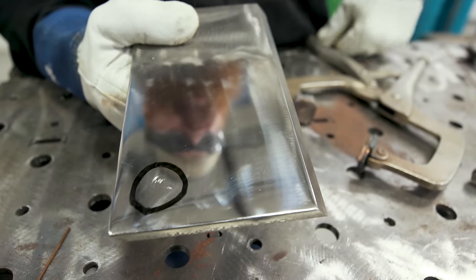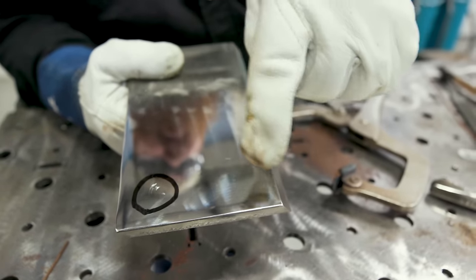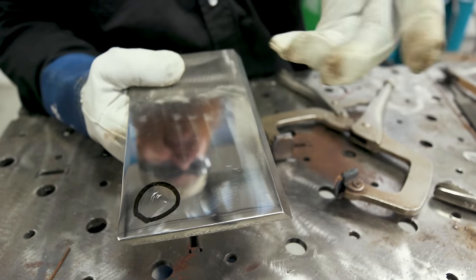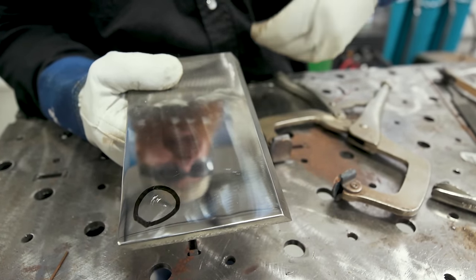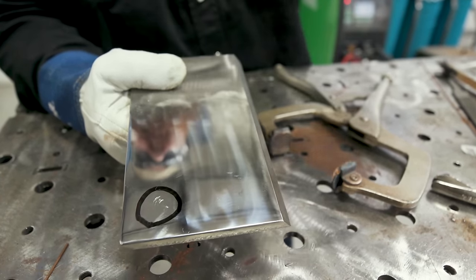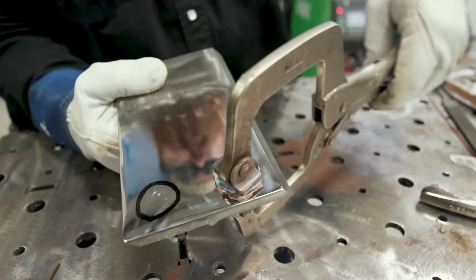A lot of people will use a piece of wood in there to clamp it up so they don't mar or scratch it. Some people use plastic end caps — but what that ends up doing is, if you put any heat near that plastic end cap, you start melting it to the material you're trying to protect. Then you end up with melted plastic all over it and have to clean that up, scratching it in the process. If you use wood, it works, but as soon as you let go, the wood falls off and now you need multiple hands to hold everything in place.